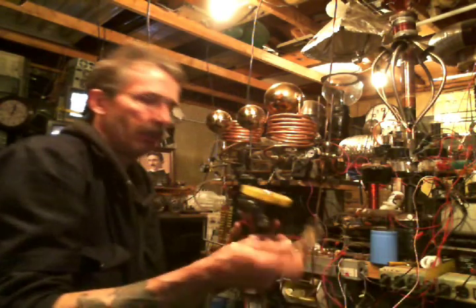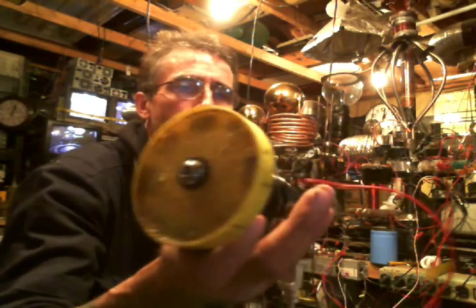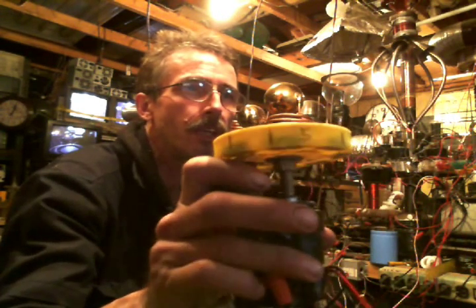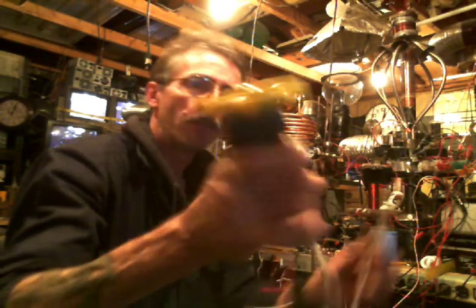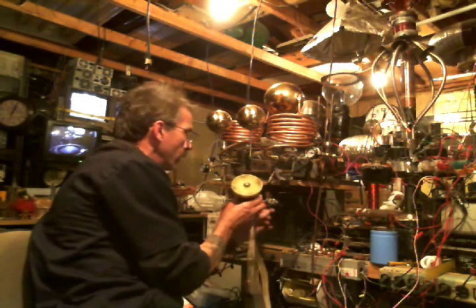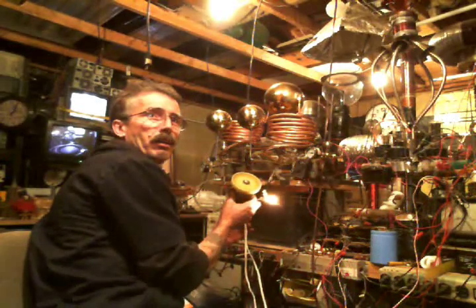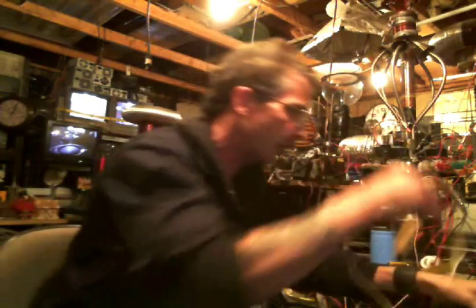Okay, I'm back. What I've got here is a little mini generator I was explaining to you a second ago. It was made out of some neodymium magnets and some two-part epoxy resin inside of a peanut butter lid. It's also made with a cordless drill motor and a little U-shaped coil out of like an old bell or old buzzer. I'll hook it up to my battery over here and you'll get to see the light come on. That's a pretty nifty little deal — just made out of junk.